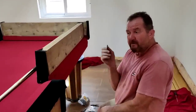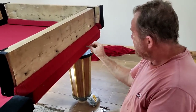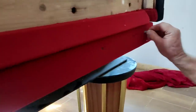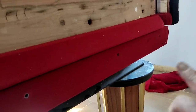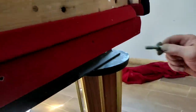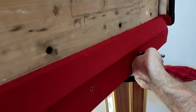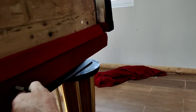Okay, just thought I'd show you this. It's working. So I've got 8mm roll plugs, and we know the thread is roughly 10mm inside. I'm going to find the hole and just push them flush. So it's there, and now I know that the end of the thread inside is that deep. You push that in until roughly that deep. Just give that a little tap. Little persuasion. So obviously this is 10mm, the holes are 8mm, so this won't go through.